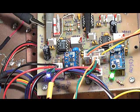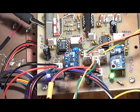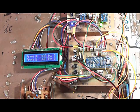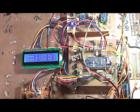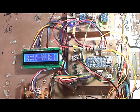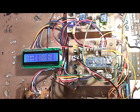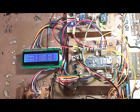This little test set up consists of a couple of AD9833s driven by a nano. There's a closer view of the nano and the little display, and there's a knob here that I can vary the frequency on F1 and also the frequency on F2. There are two frequencies coming out of this test set up.